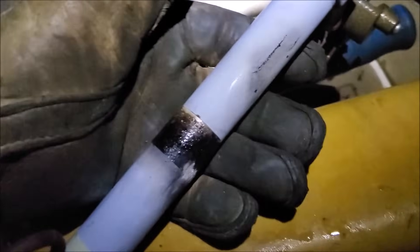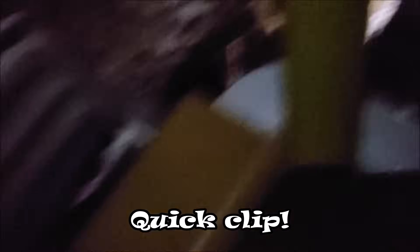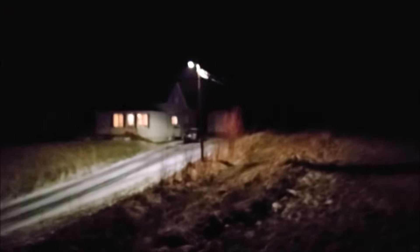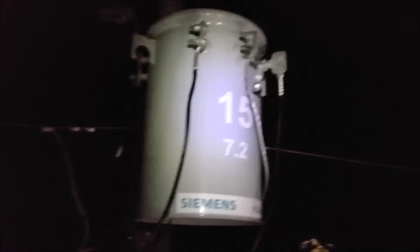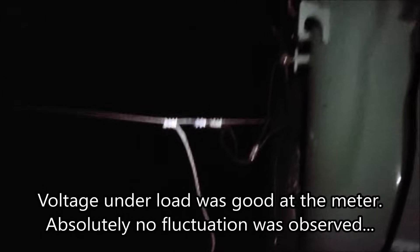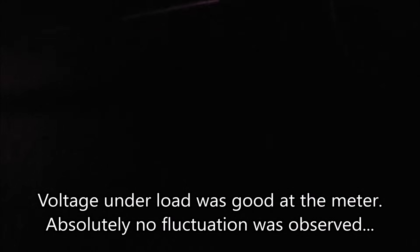Now this door is actually hot — that's burning my hand right through my leather glove. There's a house over there. See the service pole? Brand new transformer. First thing I checked on this all-new installation was to make sure all of our connections were actually crimped up in place. Keep in mind, the voltage is good right now — 121 per phase.